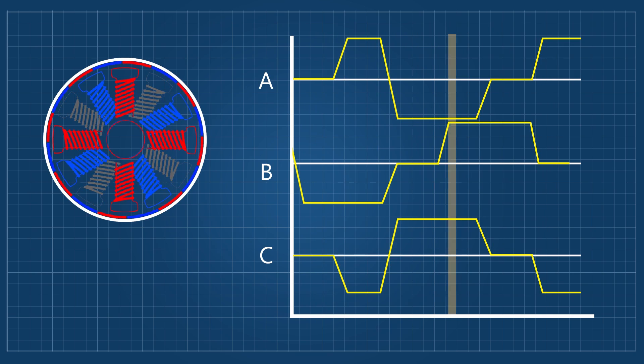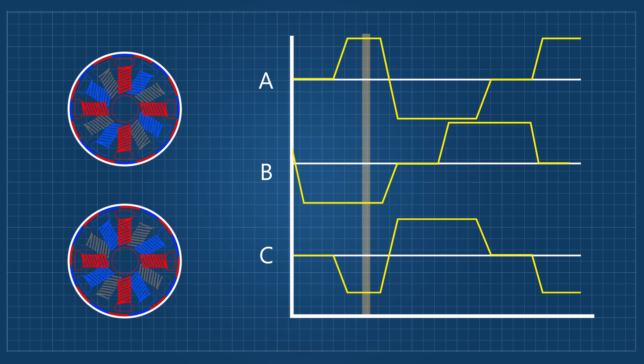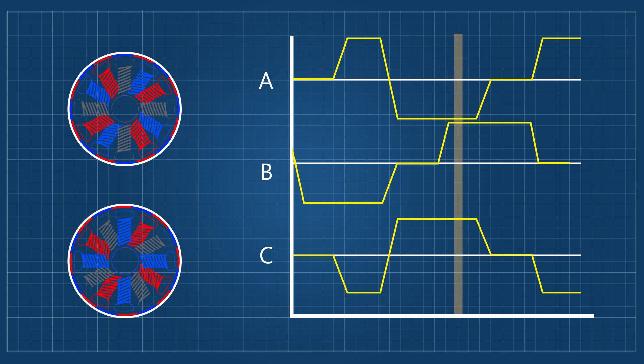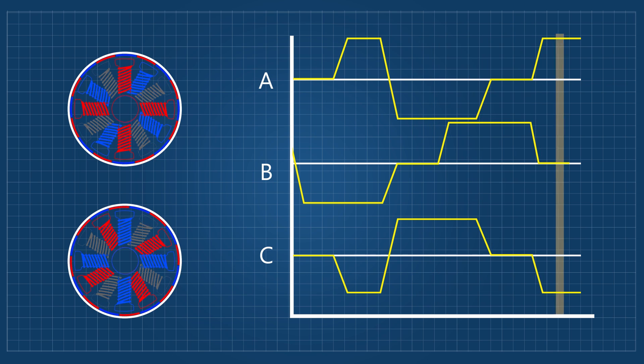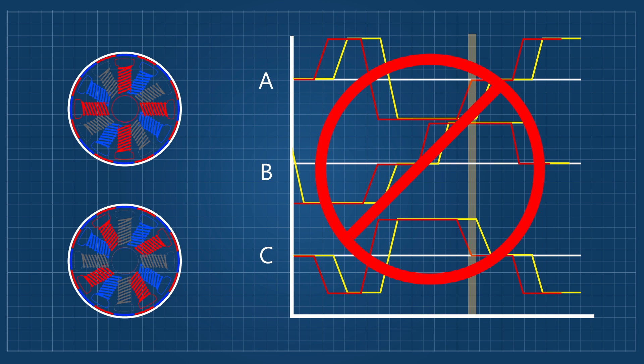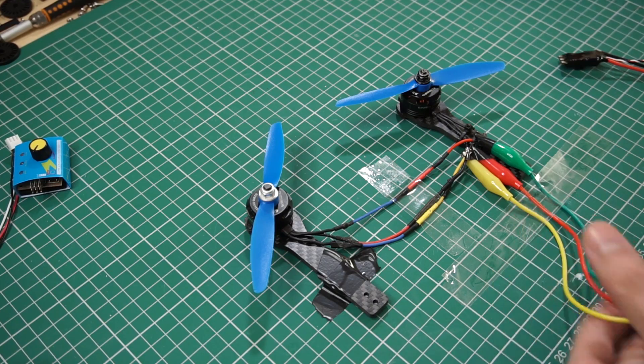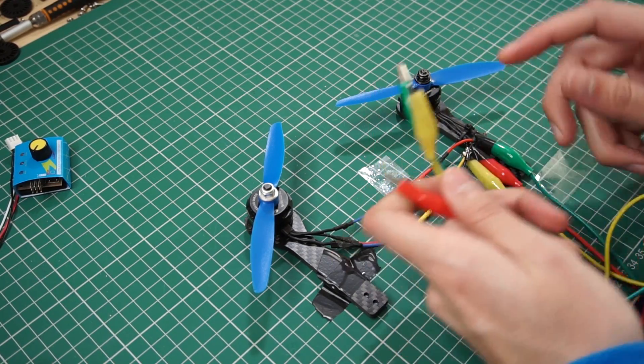The disconnected phase is used to capture the magnetic force of a magnet, and in this way the ESC, when receiving this signal, will know when to change the next phase at the precise moment. This happens hundreds of times per second depending on the speed of the motor. If we add another motor to this system, many problems might occur due to its dependence on synchronization. If one motor is not synchronized, it will generate corrupt signals that the ESC detects as an error, stopping both motors.